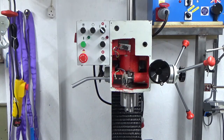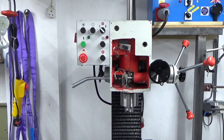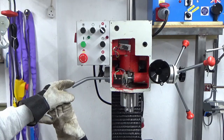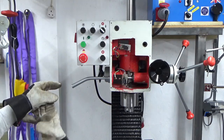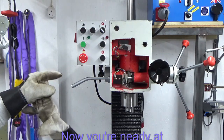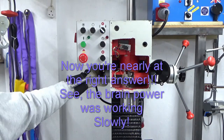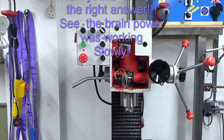I just need to get it to the point where that screw stays absolutely tied to the shaft the whole time, so that whenever the shaft moves, the screw moves with it. Because what's happening at the minute is the shaft's moving, the screw's staying static for some periods of the movement, which is causing it to either tighten up or go too loose. And when it's going too loose, the whole bell housing's then dropping off the pins that hold it in place against the spring tension. So something's not quite right there.